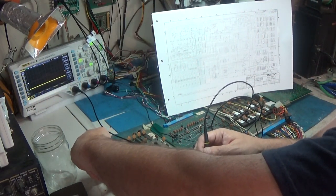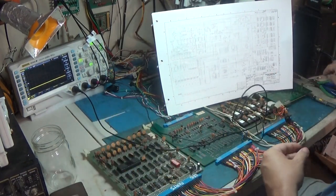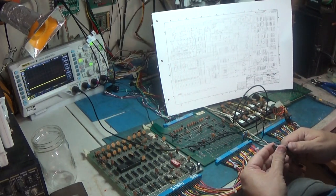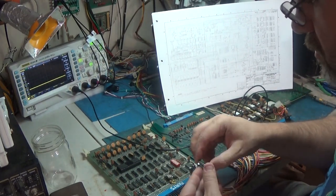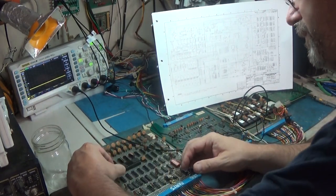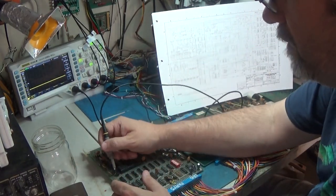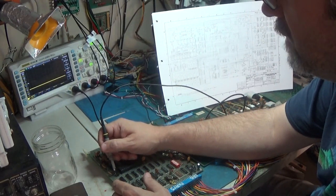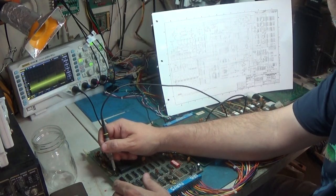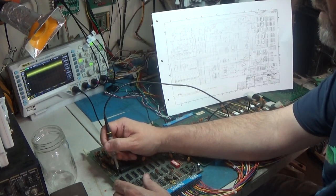We got another line of nonsense on the screen. Let's do this. Let's take pin 7 and remove it out of this equation, jump this, and then see what pin 7 tells us. Is it toggling? No. 6 is toggling, 7 is not. Or is it 9 and 7? It is. It's 9 and 7, not 6 and 7.